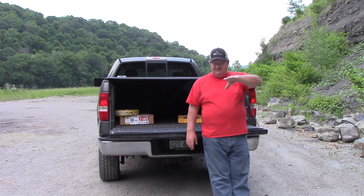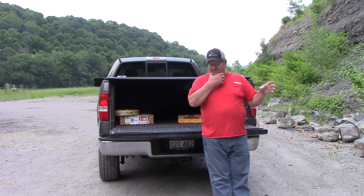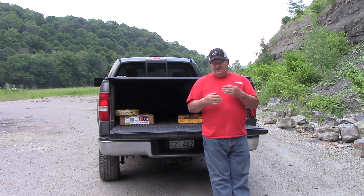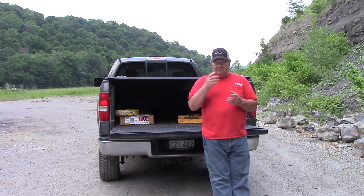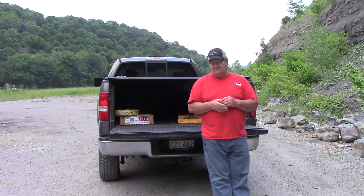A couple of outlets and a light switch. And then one circuit for the kitchen area — same thing. So that's all the electricity is going to be in there. And I'll be setting this up with a switch so I can put my solar power on to power it, or I can throw a switch and use the generator. And I'll set it up so that if I do have to run the generator during the wintertime, it will charge the battery bank while the generator is running.